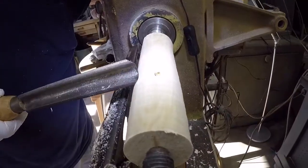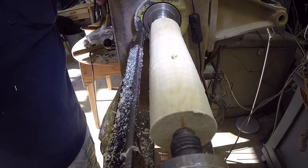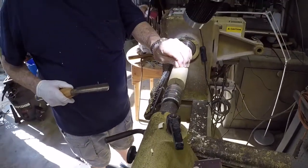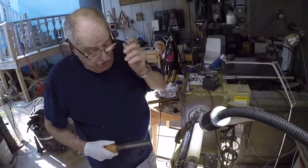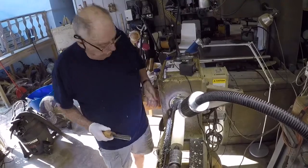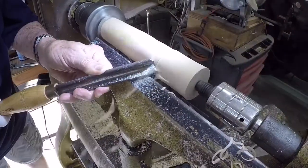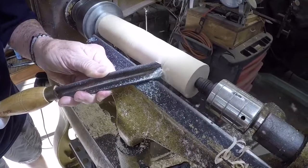But look down in there and you will see the tear-out that comes from just straightaway cutting. You're going directly across the grain instead of shearing. And you want to shear everything if you can possibly do it. So we'll take this and make it real smooth with just one little fine cut, and you get that nice stream coming off of there.